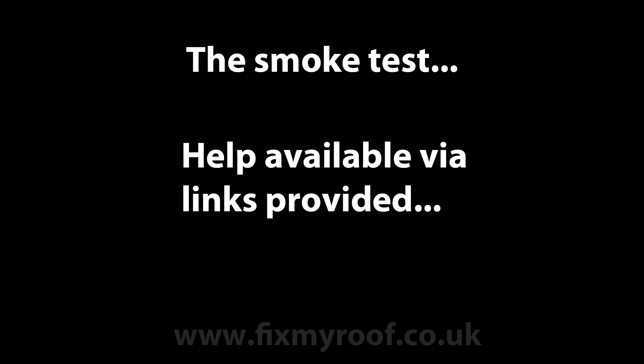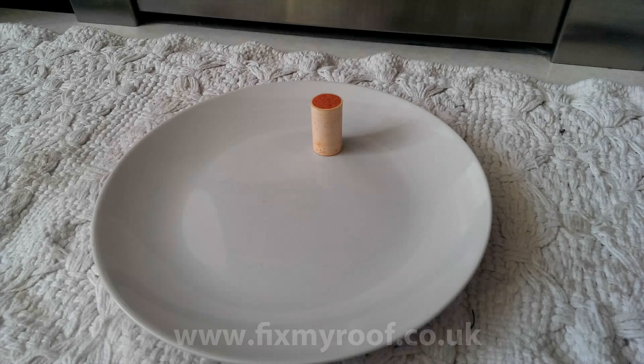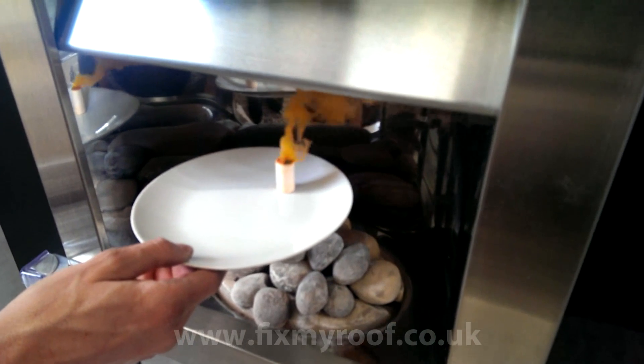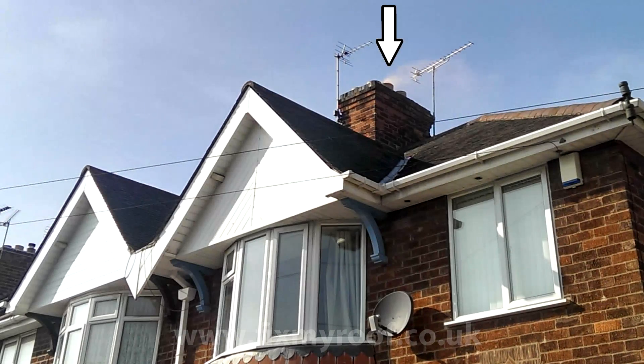It gives you links to support pages on my website. For safety reasons always smoke test any chimney flue with a good quality smoke pellet or smoke bomb before you fit a cap or a cowl to any pot. I cannot stress how dangerous it is to cap off the wrong pot. Here I'm going to use a highly visible coloured smoke pellet in a disused front lounge fireplace that is being removed. By placing the pellet on an old saucer it's just a matter of lighting it and positioning the lit pellet in the throat of the chimney. Remember to follow any instructions on the packet about ventilation requirements. From the outside you should see something like this.